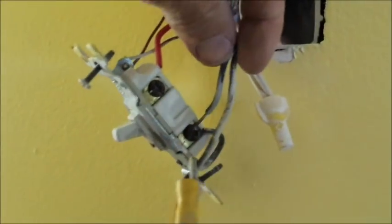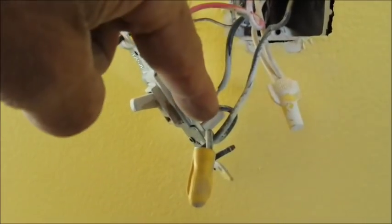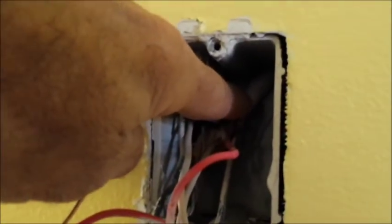Sometimes you'll see these nutted back here and then a single wire coming off of that wire nut onto that terminal. In this case, they just made it easy on themselves and looped it through there and then nutted it to that one. So what we've got is a hot wire coming in — this black wire goes through here, connects to the terminal on the switch, goes back out, and it sends power on down the line through this three-way cable.